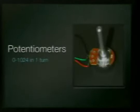So here's my little board, and I'm going to push this, and it's going to say C all the way over on the side. And then I'm going to hit the next one, and it's going to say B or A. B! And then I hit the next button, it says A. And the reason it's filling up the whole screen is because that's a really fast serial connection for just hitting 3 buttons. So it's printing a bunch of A's and such.